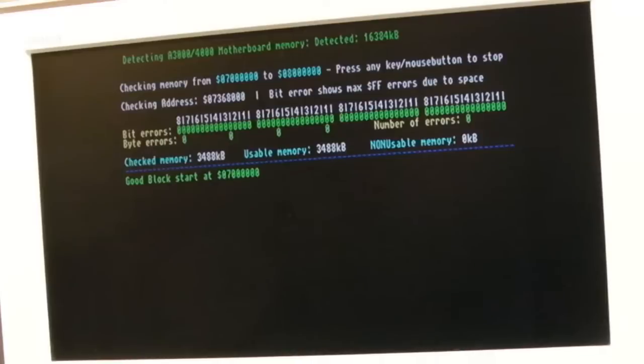Anyway, that's working. So, just testing out this system with Diagnostic here. Everything's running fine. I've pretty much finished cleaning up, you know, tin and pads and things. There's lots of videos, there'll be a few links top right here covering that sort of thing, using braid with some flux and some solder and tin up traces. Yeah, so I've tinned up pretty much every single bit of copper and corroded pad that I could see. And it's working perfectly. The reliability of the real-time clock is perfect. So other than a quick scrub on the top side around any bits of dust and dirt, and the board is a bit dusty, yeah, I just need to turn my attention to the underside now.